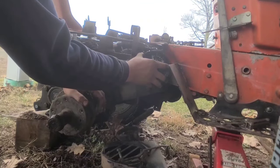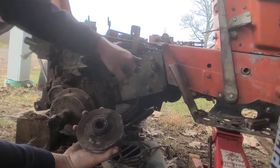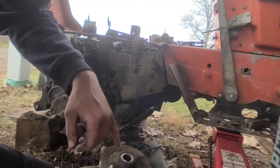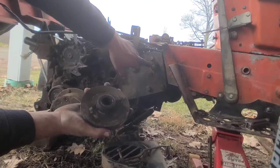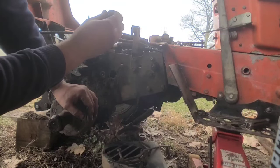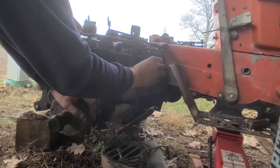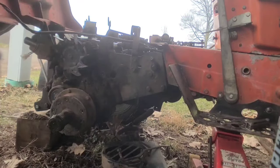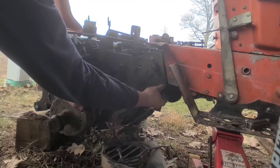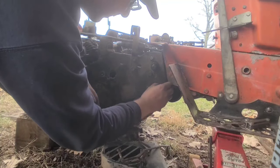To my surprise, I took the nut and the washer off, then did the keyway and it actually came right off. The gear oil comes out through here a little bit - the spacer in here actually seals up against the flat surface on the pulley and keeps it from leaking oil. When I put the new pulley on I'll put some RTV right here to seal up against the spacer and keep it from leaking. As you can see it's a little wet down there from leaking some oil. Key is okay, no problems there. I'm going to leave the spacer in so I don't damage the seal or get dirt in there.